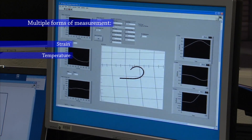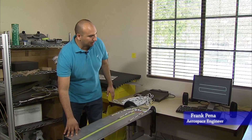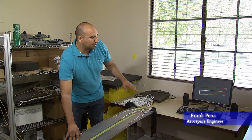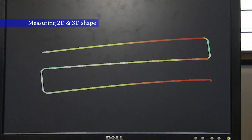One of the powerful aspects of FOSS is not only the number of measurands you can monitor — the measurand being strain or temperature, basic engineering parameters used to quantify a structure's performance — it could also measure liquid level, magnetic field, and three-dimensional shape. As I apply pressure on this test article, we can see how the shape is changing as well as the intensity of the strain being felt by the test article.